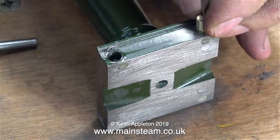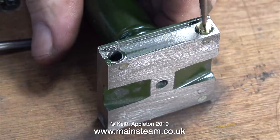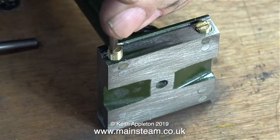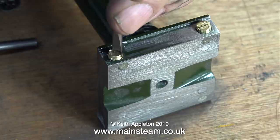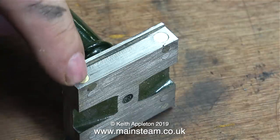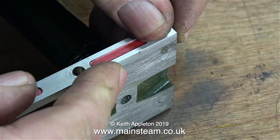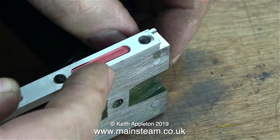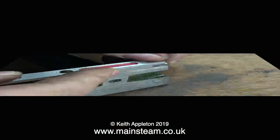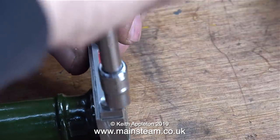Once I'd finished threading the holes, I turned it upside down to get rid of all the chippings, and now I'm screwing in some brass plugs that I made. All I did was thread a piece of brass bar quarter by 40 threads per inch, but before I chopped it off on the bandsaw I used the bandsaw blade to make a screw slot in the top, then I chopped off two of them, and here I am screwing them into position with some Loctite 603. If I were a proper engineer, the next part of the job would have been to put the column in the milling machine and mill off the top — but no, I used my belt sander. The one inch belt sander is very good for things like this, and because it's just there ready to work, it's quicker than setting up the milling machine.